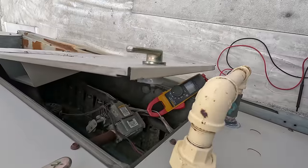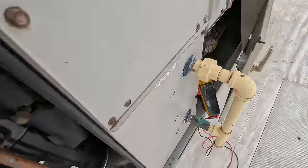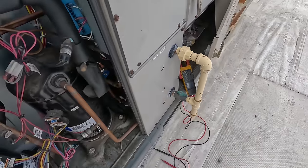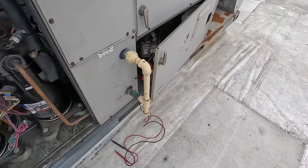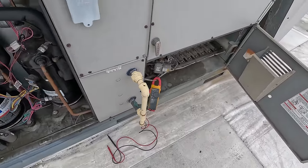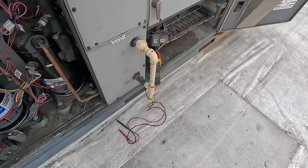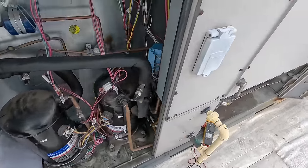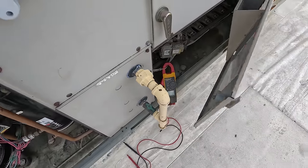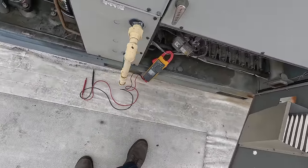I can't record it and do it all at the same time. 30-second pre-purge, so you've got 30 seconds before it's going to try. In 30 seconds here it should try — you should see some clickage on that amp meter. Face it, if we don't get spark, we're probably not going to get the gas valve either. Spark's usually the high voltage discharge — you're going to have failure on that faster than anything. It's been 30 seconds and nothing's happened. Let's go ahead and check voltage.